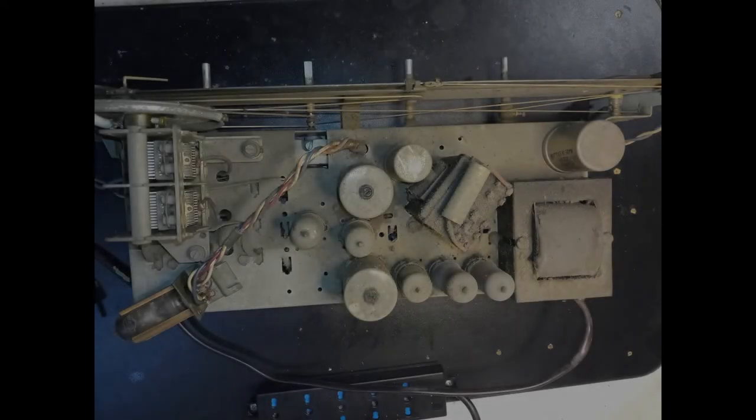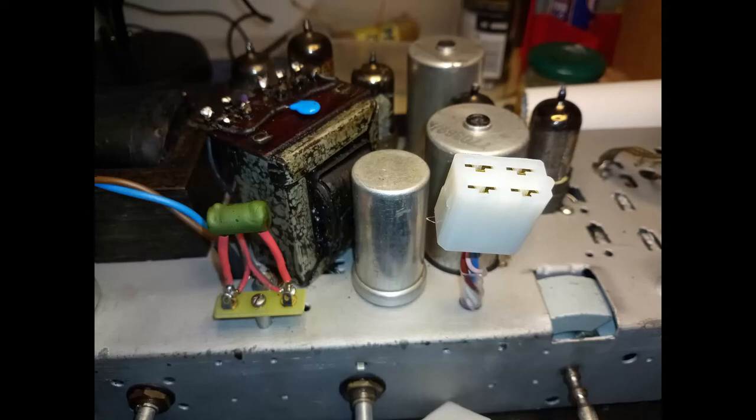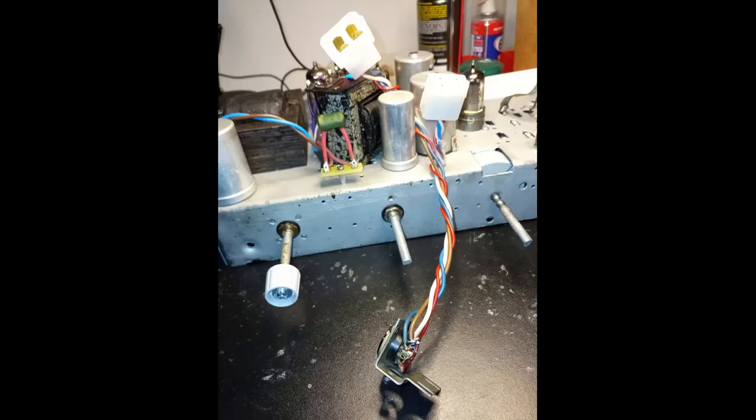This radio model includes a magic eye, which was originally not separable from the chassis. Considering that it is possible to detach the magic eye tube without interfering with the rest of the radio, it seems to be appropriate to put a connector for that. Some spade connectors are used in this case.